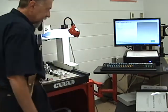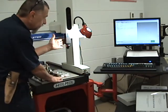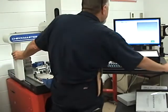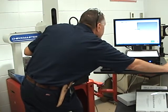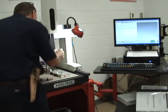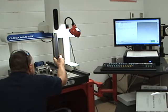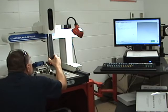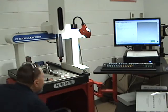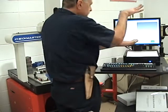Now I'm going to do a part coordinate system. The machine knows where it's at, but it doesn't know where my part is in relation to X, Y, Z. So we're going to touch on top of the part four times — go to measure, plane, shortcut B. I want to hit Z negative, coming down on top of the part rather than the table. I tap four points right on top of my part and it gives me a plane. When I hit J and L — Orient and Origin — all of the Z goes away because now it knows where the top of my workpiece is.